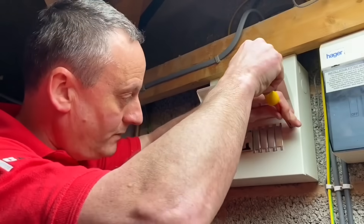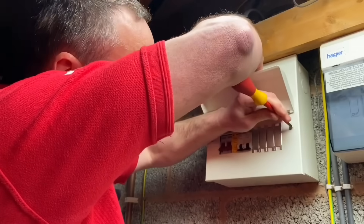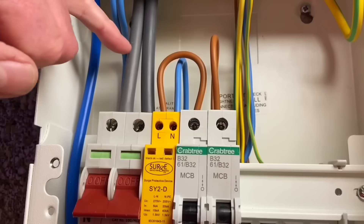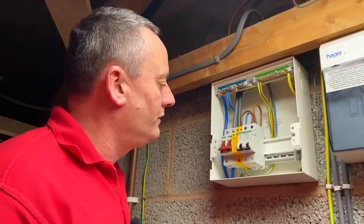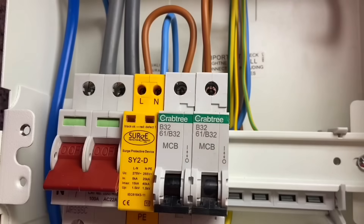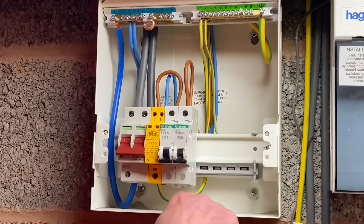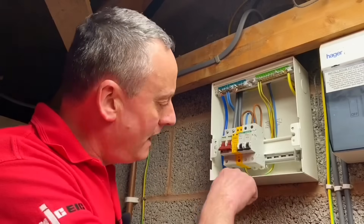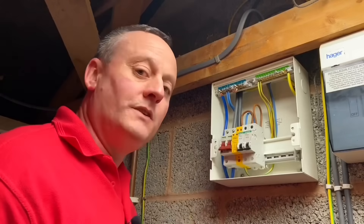With the cover off — note the stickers are still to be installed, so final commissioning hasn't been done yet. We've got 25mm² meter tails coming in. We've got a 32-amp breaker feeding the SPD and a 32-amp breaker feeding the EV charging point. Has there been any special consideration about conductor length for the surge protection device? Yes — it must be kept super short. The protective conductor out of the bottom goes directly into the earth bar, and the conductor across here loops straight across. That's the half-metre combined length rule, and we can clearly see it's been kept under it.